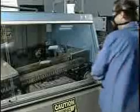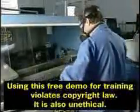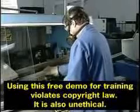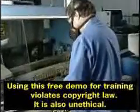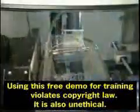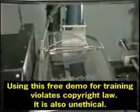Let's take a look at some typical preventive maintenance procedures. Some companies require removing dross from the solder pot once per shift. Other companies do this only every 24 hours. There are wave soldering machines that use an enclosed nitrogen blanket to reduce the formation of dross. Removing dross from the solder pot in these systems is required even less often.